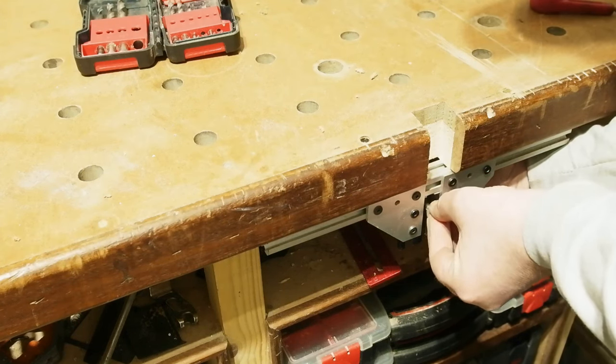The very last thing then is dialling in the fence scales. I like to set my stops so the increment line is visible in front of the stop — I find if you work so it's on or covering the line you end up getting variants. There's no trick to this really: it's just set roughly in place, cut and measure a test piece, then loosen the fence, adjust, and try again if needed. It took me three or four goes both left and right before I was happy, but it's worth spending a little time on. I'll reiterate here as well: if like me you don't keep your fence in place but remove it when not in use, double up the fixings in the fence dogs to really lock them in place — forget the single star knob option on the fence dogs, they just don't cut it.